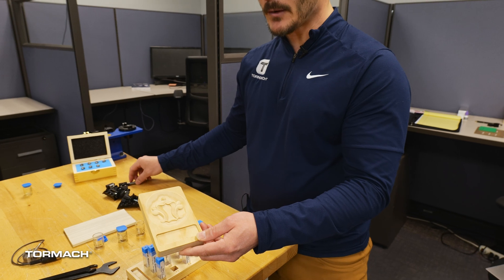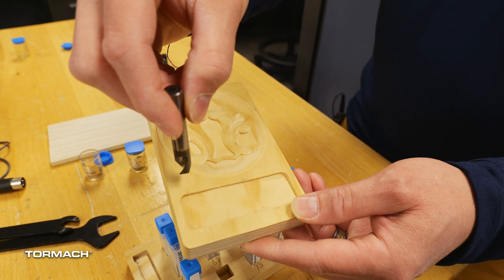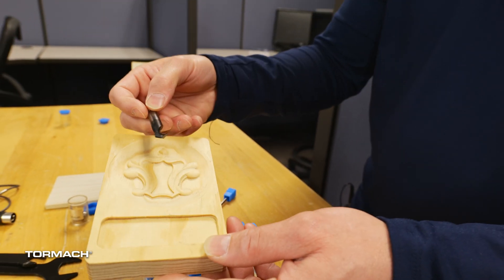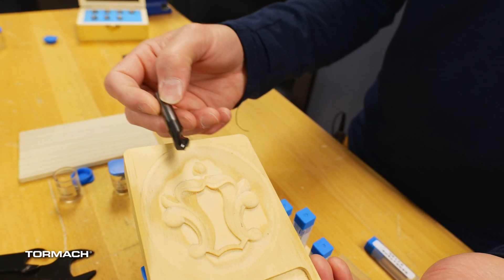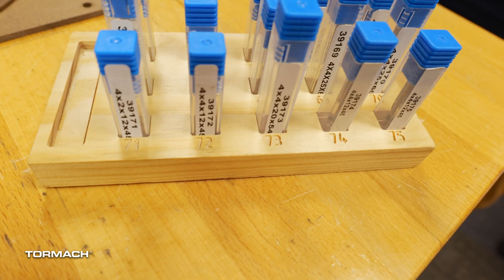The other tool that does not come with the kit, but I would recommend looking into, is a V-bit. This is great for chamfers on edges, drilling hole starters to ensure a nice point at the start of your hole, or 3D carvings where you need a sharp edge rather than a curvature — like a name or graphic. These are available, and we have this organizer set up on our forums where you can download the plans and mill it out. The link is at the bottom of this video. That completes our video on the different tooling that comes with your XS Tech. Please subscribe for more videos in this series.